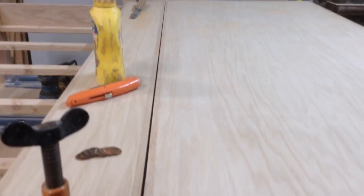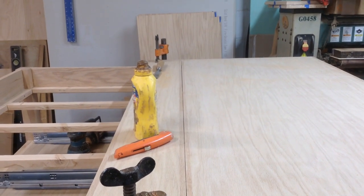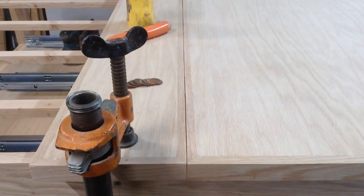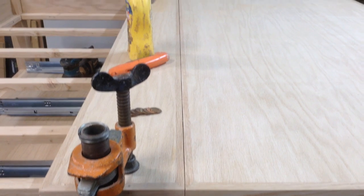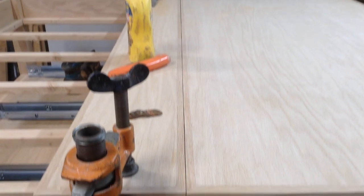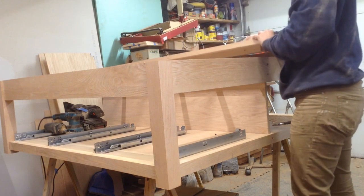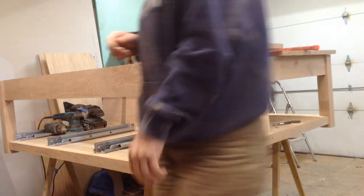My reveal shifted a little bit, so I went to the underside with only two screws in to start, shifted it, then screwed everything into place and it worked fine. That's par for the course with hardware — there's always going to be some finagling. Once I got the reveal where I wanted it, I put all the hardware in. Since I'll have to take it all apart to stain and then apart again to move it, I marked the position with a pencil for easy realignment.